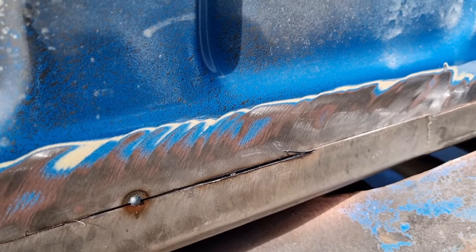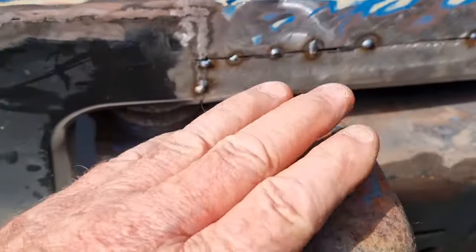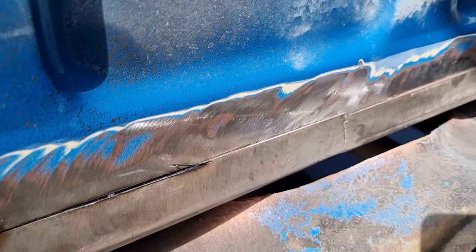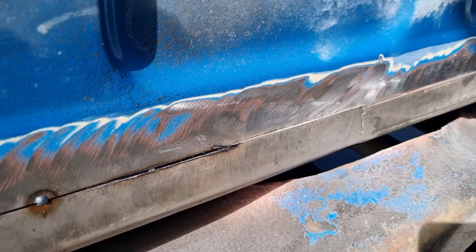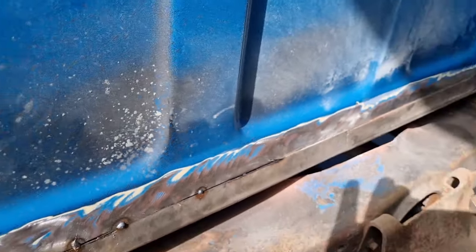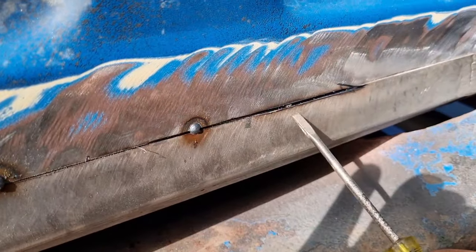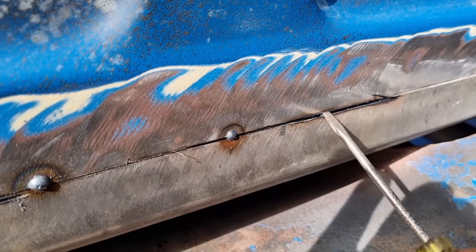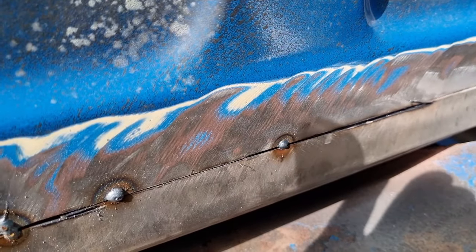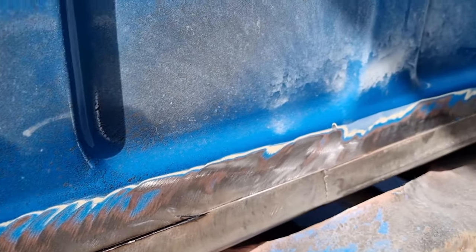It's a little bit of an awkward position. Well, it's okay through there, but it's a bit awkward with this brace here. So a bit of a miscut there, but that'll be okay. So just running along there, I will cut a bit more, and then the two pieces of metal pull together. And if they don't, then I just assist them with a screwdriver by just pulling it one way or the other, like that, lining them up. Once they're perfectly flush with each other, then I just put a tack there and move along. So I'll move along this way.